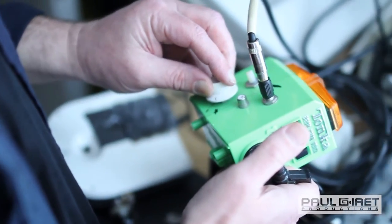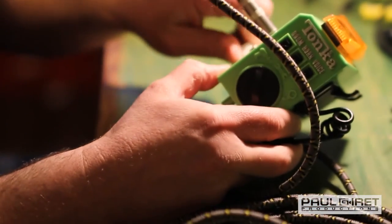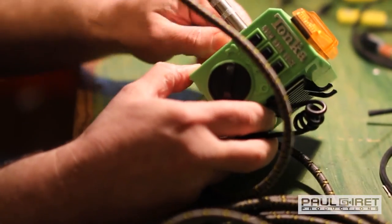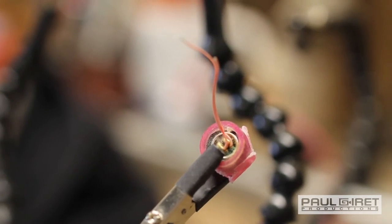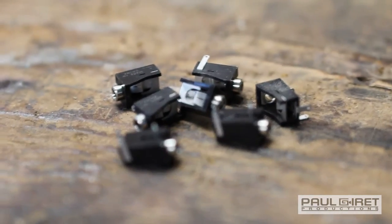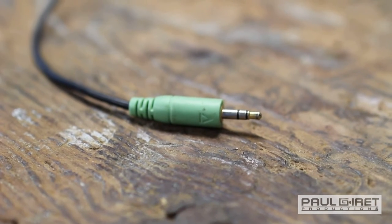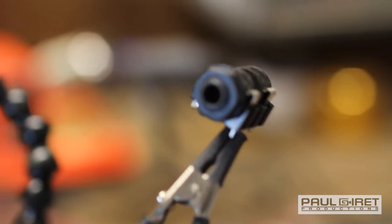A lot of these things are designed, we played with little toy sets with little tiny speakers. When you plug them into actual speakers, they sound different than you would expect them to when they originally were working. Because most of these toys just have little speakers on them. So you cut those speaker wires, and instead of having a speaker, you put an 1/8-inch jack so that you can plug in an 1/8-inch plug and then source it out to a mixing board or your computer or whatever you want to record to sample it, so that it's the best possible quality audio being sent out to whatever you want to use.